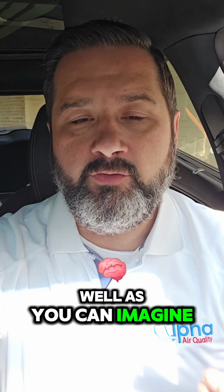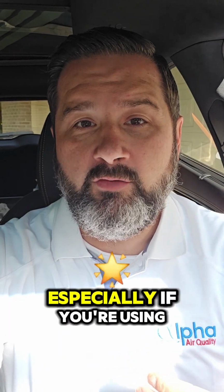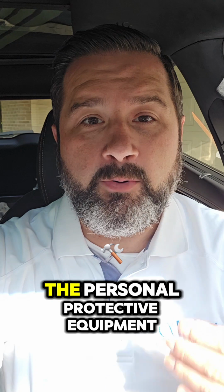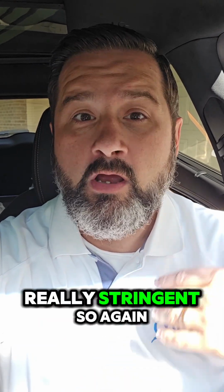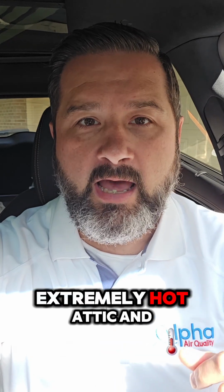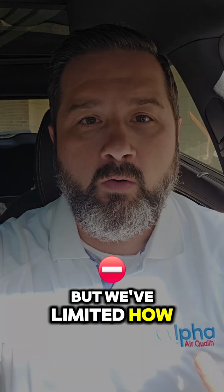Well, as you can imagine, there's a couple different issues with this scenario. Number one, it sounds really cool, but when we start talking about using that in an attic space, we're talking about a high expense. Number two, when you're using things like that, especially if you're using dry ice, the personal protective equipment or PPE requirements can be really, really stringent. So again, pair that with an extremely hot attic, and we've not only added price, but we've limited how many months of the year we're able to do that, right? And then number three, there's just better ways.